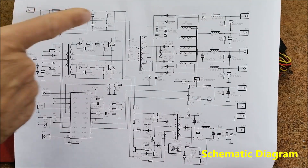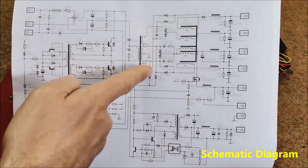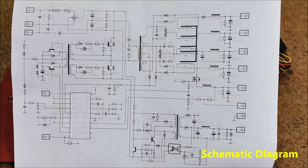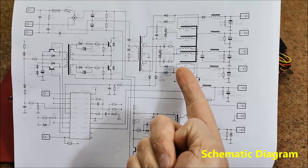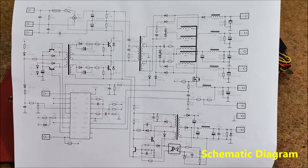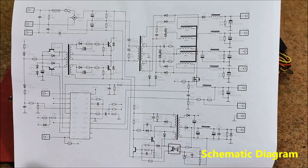Next are two power switching transistors or MOSFETs that drive the primary windings of the main transformer. We can recognize this transformer by the fact that it has the largest dimensions. On the secondary windings of this transformer there are Schottky diodes and chokes, and also capacitors that filter the output voltages. In our case the secondary windings of this transformer are the most important, and you will see why in the following.